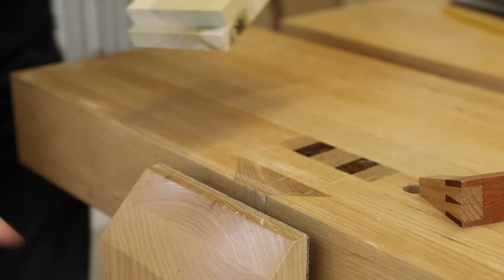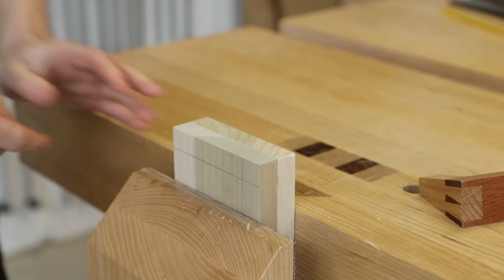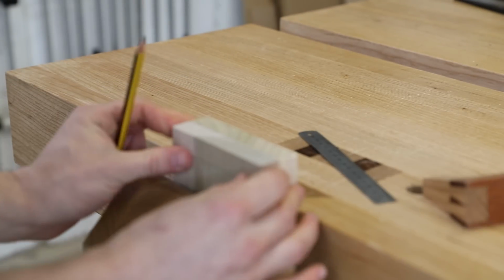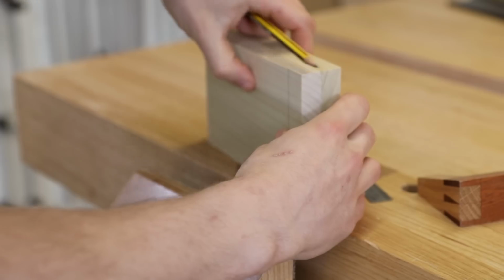So here you go, here's our two components that are due to be nested together. So on this, I've done the pencil line down the bottom so we can still mix in the invisible baseline technique if we wanted. So get them clamped in the vise, same height, and make sure the edges are perfectly flush. So don't only check at the top, but also check at the bottom as well, because you don't want them to be twisted in here.